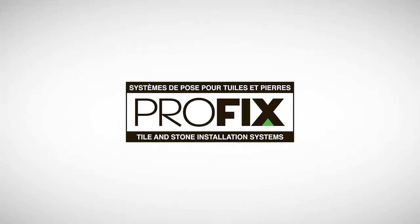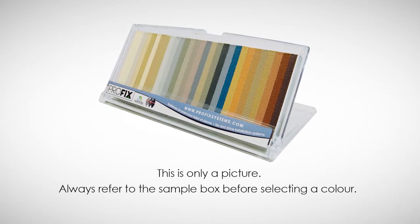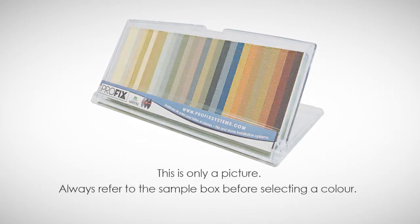In this video, you will be shown how to install Profix Poly500 sanded grout. Poly500 is composed of hydraulic cement, graded aggregates, dry polymer, and chemicals. It is used to fill joints ranging between 1/8 of an inch to 1/2 an inch on walls or floors. You simply have to add water to the mix. It is available in 30 colors and 4 sizes to accommodate small and big projects.